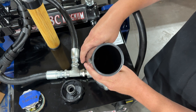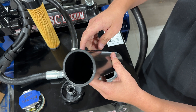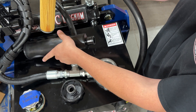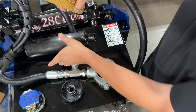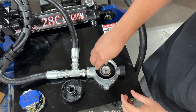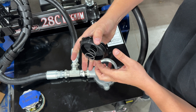Now that we've got that out, we can separate the oil filter from the plastic bucket. You want to make sure this plastic bucket is clean because a lot of the debris will go in here. Pull out the filter and the bucket at the same time so all your debris comes out together. Dump this out into your drain oil, then use some brake parts cleaner to clean the inside and get it rinsed out well. Take your new hydraulic oil filter and make sure to lube around the o-rings really well. Slide it into the bucket and pop it in — see how it kind of seated there. Drop the whole thing back into place, feel it seat. The spring will keep pressure against the oil filter. Make sure to oil this o-ring as well before you put it back together.